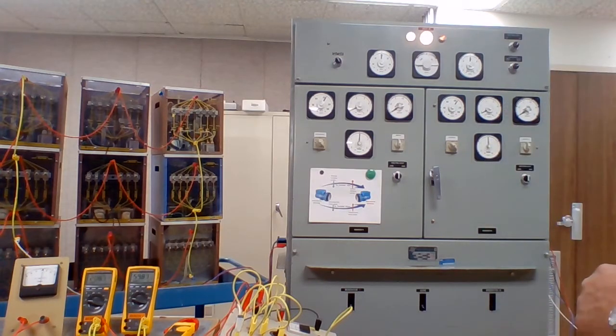So first off, let's just change the speed a little bit. Let's bring these closer to the same speed. So now our generators are running at just a slightly different speed, and you really see those bulbs go through a pattern — they're never all the same at the same time. And the reason for that is we've got the incorrect phase sequence.